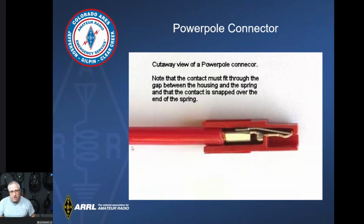This is kind of hard to see, but when you talk about the connector, there's two parts of the part that you see on the end, and I'll show it to you in a minute. But that top small part where the hook goes up, they call that the tongue. And it's obvious when you see it. So the rule of thumb is tongue up, spring up. When you're orienting to put them in, have your tongue on the upside and have the spring pointing up, and it'll slide in every time. It took me a while to figure that out, and it was always a 50-50 shot of whether I got it right or wrong.